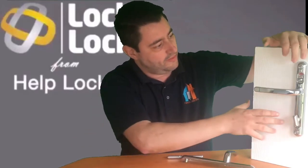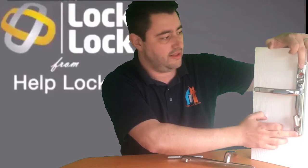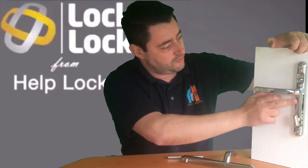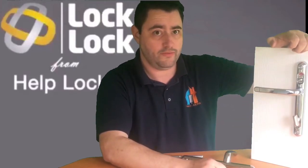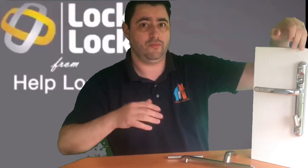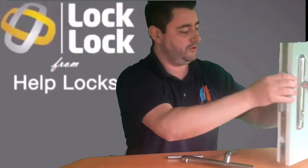The two handle sizes I mentioned, while we're looking at the screw fixings. This one here is what we would call a long handle. This is 211 millimeters between the two screws. On a short handle, the top screw would sit below the handle grip here. So from here to here would be a measurement of 122 millimeters. Most doors that are 10 years old or less, I would say 95% of doors roughly, will fall into one of those two handle sizes. But before you order the handles, it's worth double checking on the door that you're planning to put these on.